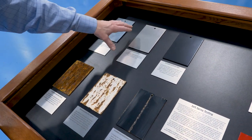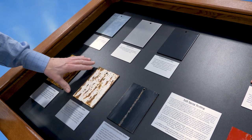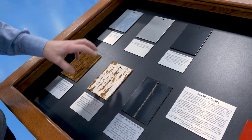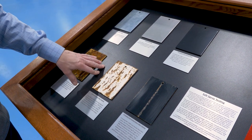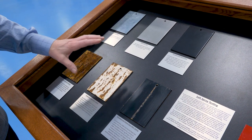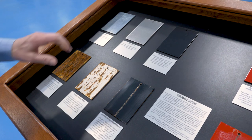The second panel is a galvanized panel, subjected to the same thousand hours of salt spray. You can see it has a white chalky film on it as well as some rust color. That galvanizing is doing exactly what it's supposed to do — it's holding up. It can be cleaned up and it would look quite well after it was cleaned.